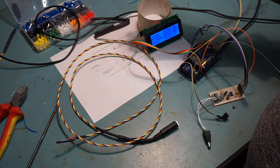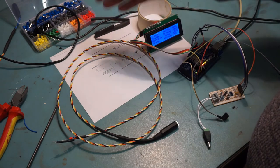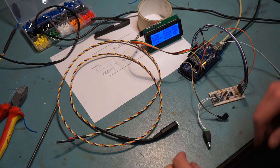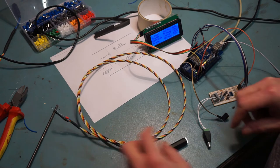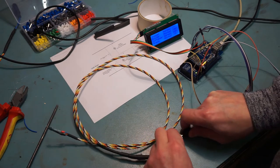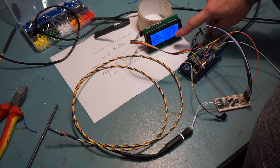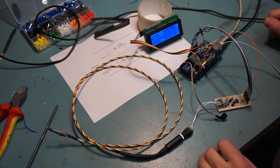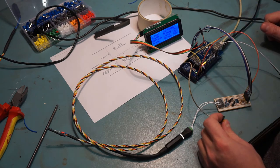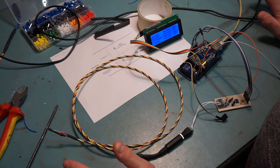Recall that this is a potential divider, so it's going to get an ADC reading of about 512, which is 50%. All we're trying to do is bias the input up or down. If I plug the leak rope in - remember I've put a 6 megaohm resistor at the end of it - you can see that the shower input has gone into warning mode, and you'll hear a very occasional beep every 10 seconds.